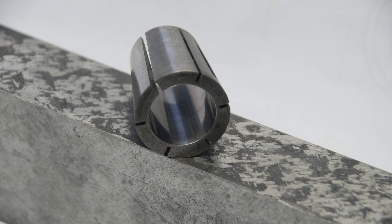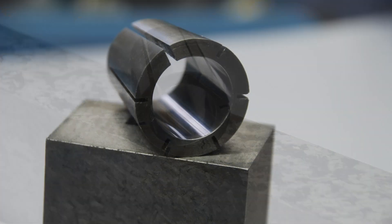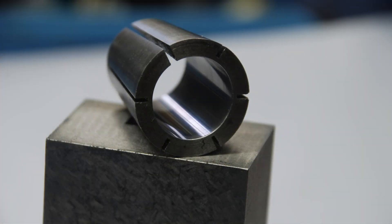Now with a really good finish and presumably a straight and round bore, we need to figure out exactly what direction that bore is going in, because there's no control over that with the lapping. I thought I'd be able to get away with it because I thought lapping wouldn't alter the geometry that much, and that with the bearing tightened up and using the shaft surface as a guide I'd be able to spot and scrape the double taper at the other end of the shaft.